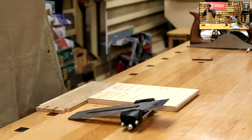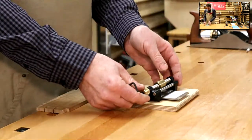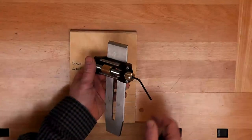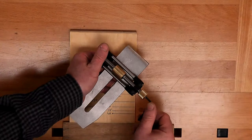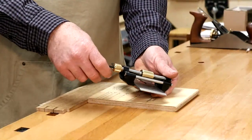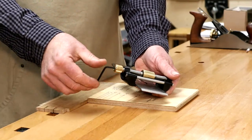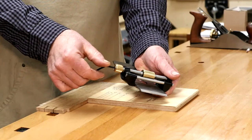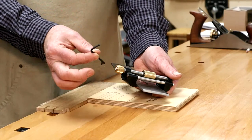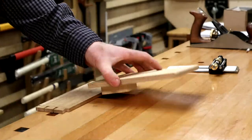Okay, so got there. If you find you can't tighten it nicely, and I like this as a feature, there is an Allen key fitting on the side. Okay, so bring it around a bit. Look on three. Tighten that up. So I can use that, or if you can't undo it, you've got that aspect, you can use the Allen key. The other nice thing about the Allen key is you get a bit of control. Don't need to over-tighten it, but you get a nice bit of control to tighten that, lock it in place. That's something I quite liked. That's a good little feature to find.